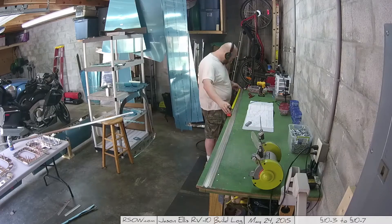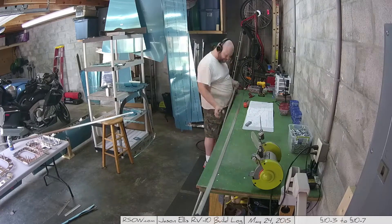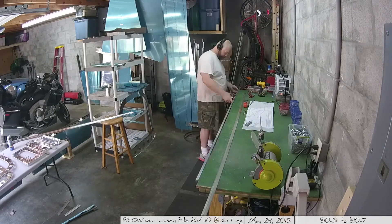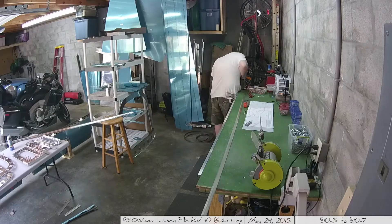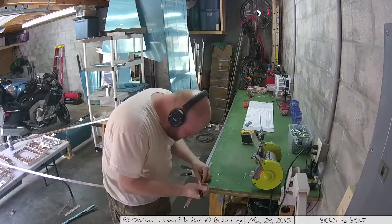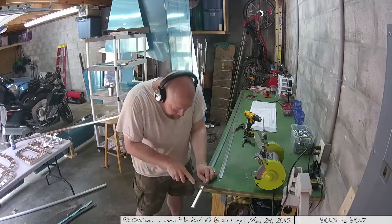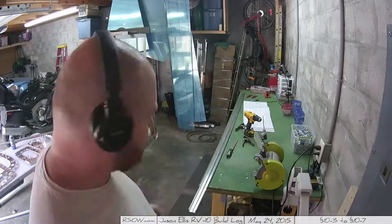These are two important structural pieces and you'll see later on where they go. In the beginning here I'm drilling some holes, then marking and removing some material from a shaded area — this is necessary because of the brackets we had already done, which fit right in where those holes are. I went upstairs and did that on the drill press, and now you can see me rasping some of that excess aluminum out of there.